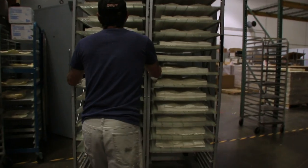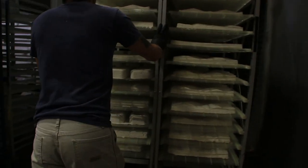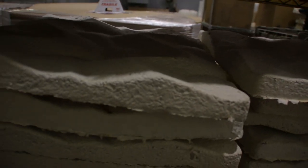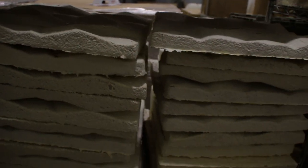Next, we'll bring this to the oven, set at 200 degrees Fahrenheit. This will stop the mycelium from growing. You'll know your part is done when it is 35% of the original weight, so you can use a scale to measure before and after, or use a moisture meter and measure when your part is 5-12% moist.